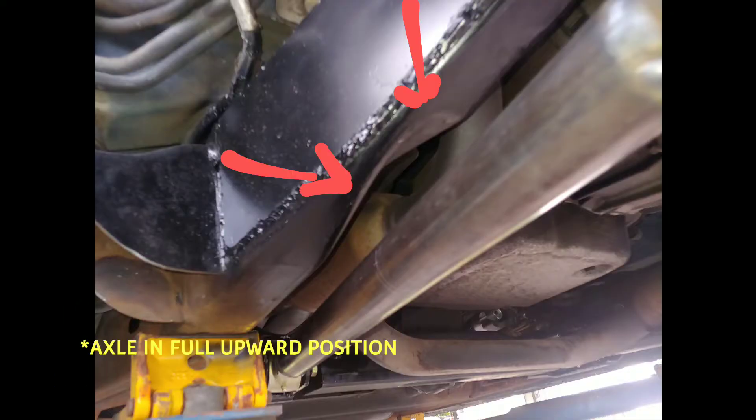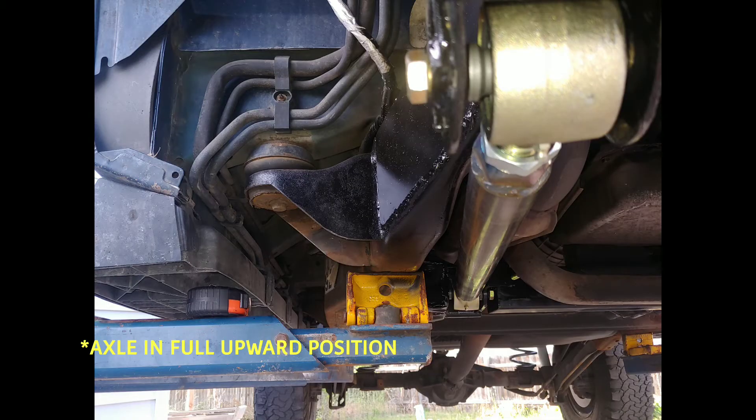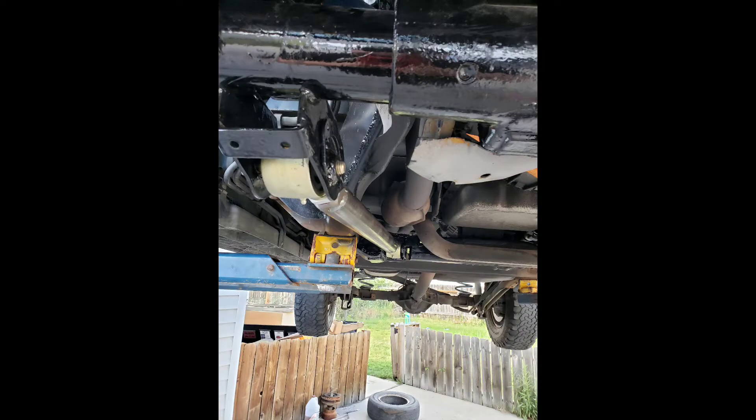As I've mentioned in my video five, this axle is just so easy to use in the Chevys — it's almost like it was made for it. With the crossmember fabricated and the axle mocked into place, you'll see that the radius arm slash lower control arm passes through the exact same pocket on the frame that the torsion bars did in the factory configuration. There's a nice little pocket in the frame and everything clears it nicely.